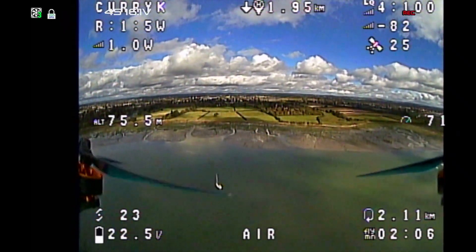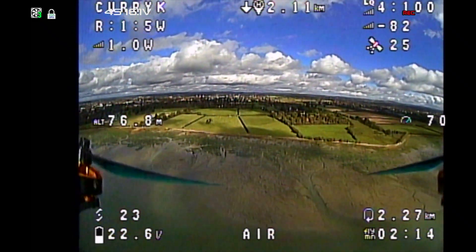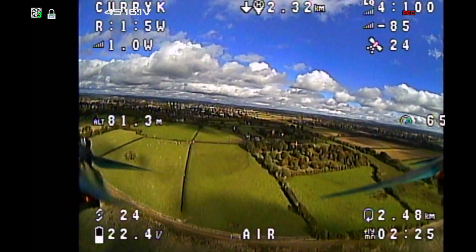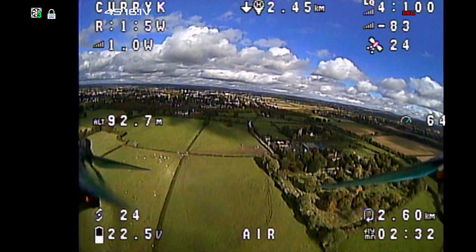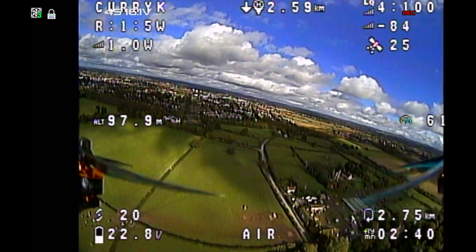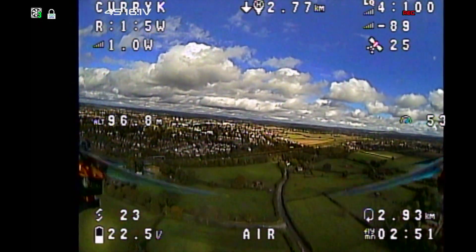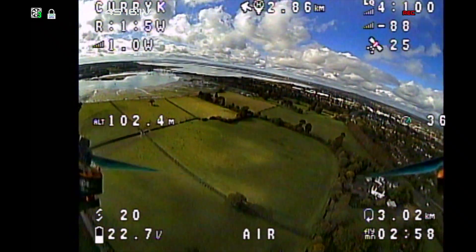It's not too far to cross over to the mainland from this island. We just passed the 2 kilometre mark and we're starting to come up on the next shore. This was the place where the 1 watt started getting a bit speckly. So it's interesting to see here if it comes clear, because essentially we'd check: that was a bit fuzzy at 1 watt, so let's see what happens at 5 watts. And yes, at 5 watts, five times the power but double the range effectively — it seems to work quite nicely. My plan was to go for about 3 kilometres, but I looked at my cumulative distance at the bottom right instead of my distance from home at the top middle. So I hit 3 kilometres cumulative where I'm only at 2.87 from home — a bit dozy of me.